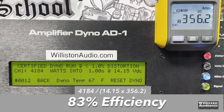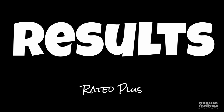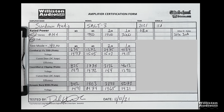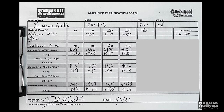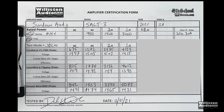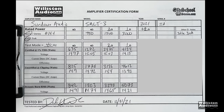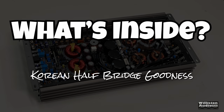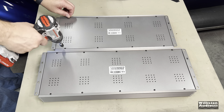As far as efficiency we're still really good — 83% at 1 ohm. For the results: rated-plus across the board — rated WAY plus. We tested 4 ohms, 2 ohms, and 1 ohm, and I also did an 8-ohm test and got almost the 4-ohm numbers at 8 ohms. This amp is just a beast. Now let's check the internals — Korean half-bridge goodness is what these amps have.